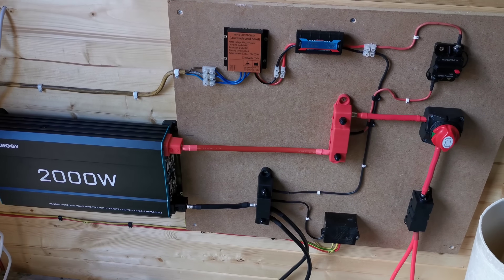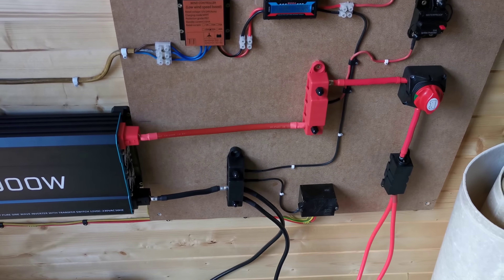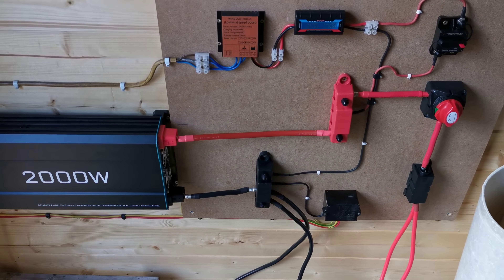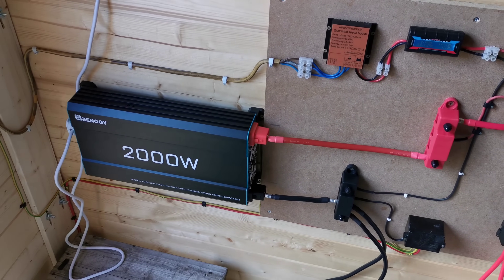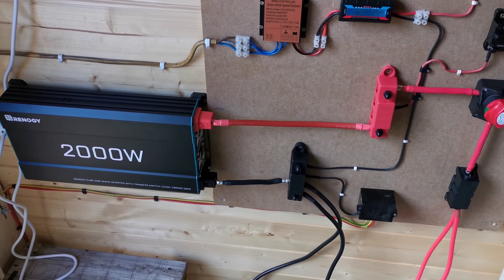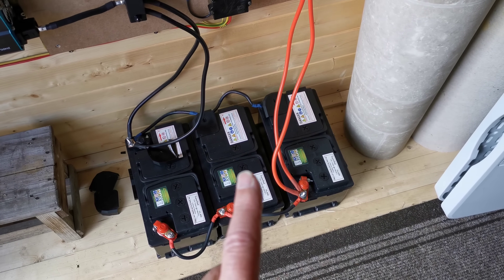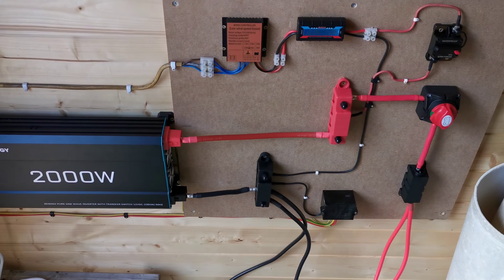What I can run off this: I've got a fridge next door in the summer house, a smart speaker, lights. We did stress test it last week — this system with those three batteries ran a washing machine through the entire cycle once, and we further stress tested it by trying to run it through again. At that point the inverter said enough and started bleeping at 11.57 volts low voltage cutoff. So it can run some serious loads. The double-edged sword with a big battery bank is it can last a long time, but when it's not windy it also takes a long time to charge back up — hence my need to augment it during summer months with a solar panel.